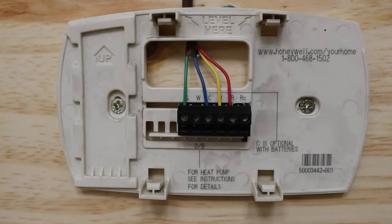You see, sometimes you can't just trust just the jumper method right away. You actually have to keep it on there for a while. Sometimes there's a timer in the circuit, so it's extremely important to have the right tools. That's why I love having a magnetic jumper. You can probably hear the fan running. That is this fan here, which is our condenser fan motor. And this light bulb here represents our compressor.